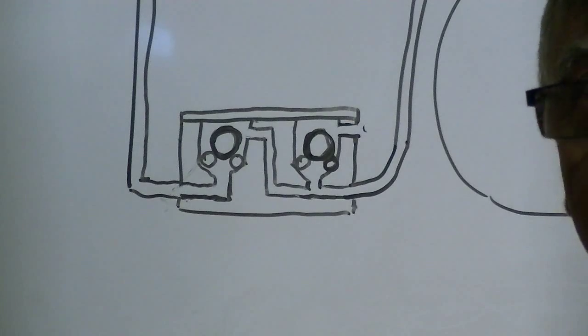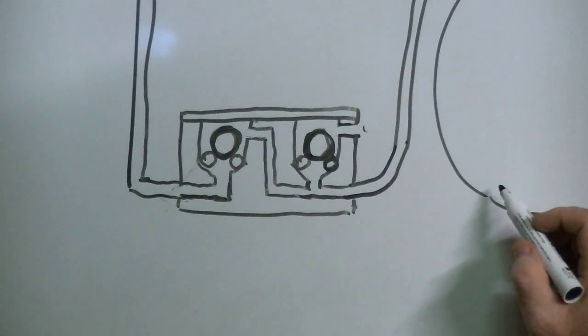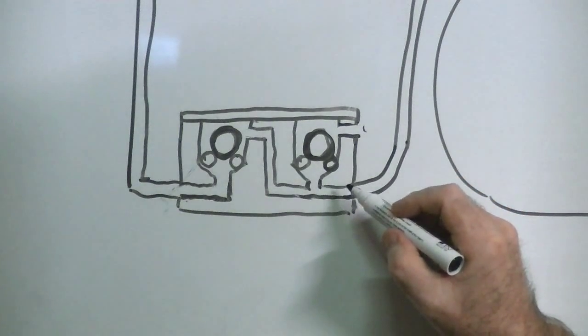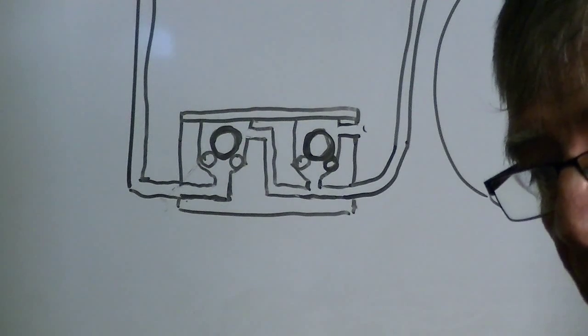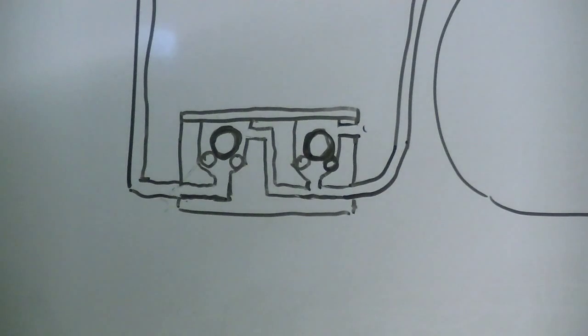This is the good bit. When the pump isn't working, the water can flow into the tank and it exerts one atmosphere's worth of pressure on this tube. And that is not enough to unseat that ball bearing, so the ball bearing will sit there. In other words, your boat, when it's on the surface, is floating on the weight of the ball bearing — it's a nice thought.